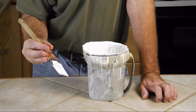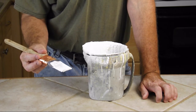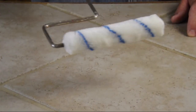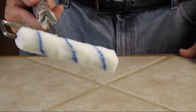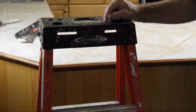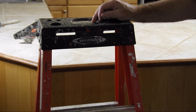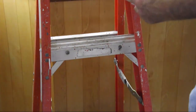This originally was just how to clean a brush and a roller, but I wanted to show you some other things. You do not have to be taping off everything in a room, and it'll look really good when you're done. By the way, this is the type of roller that a cigar roller uses — you should definitely have a couple of these. They'll get into areas the larger roller can't, and you'll have better control. This four-foot ladder is probably the most handy size for doing interior work. If I was going to get anything other than a four foot, I would get a six-foot ladder. A quick way to estimate the size: just count the spaces — each one is roughly a foot.